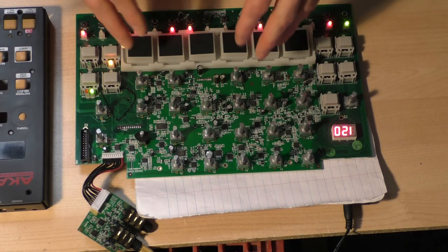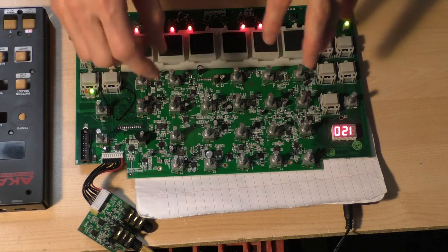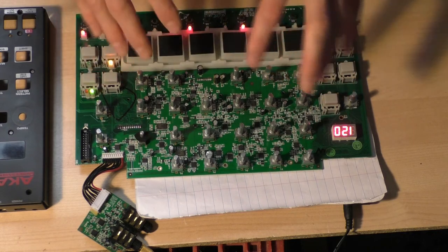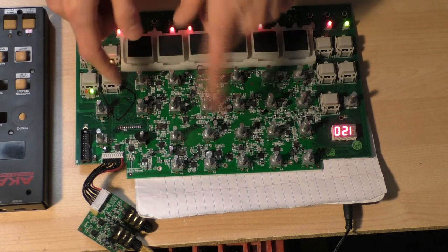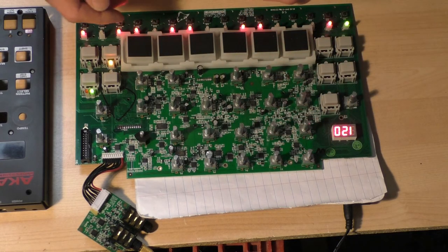I want to do ones where you just change part components. So if you can do SMT soldering, you can just pop different resistors in or take parts out to change and hopefully improve the sound. And other ones where you have to cut pot legs and run wires and do some more complicated mods.